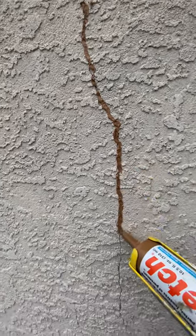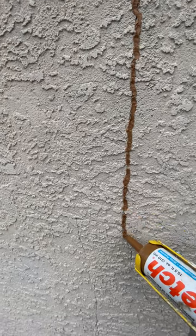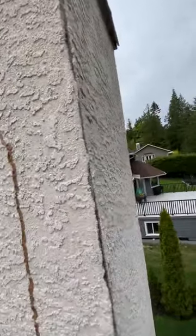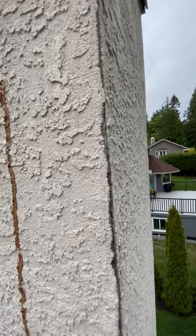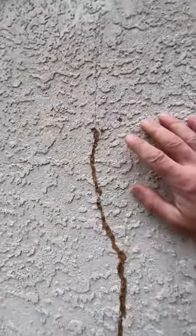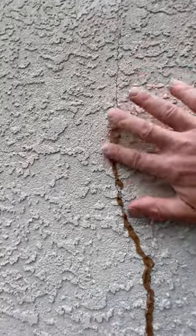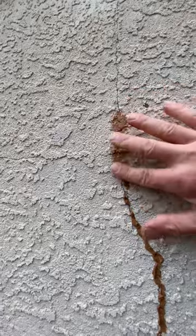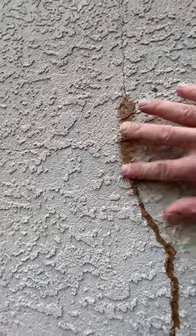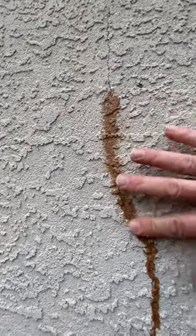I just want to make sure it's done right and that the cracking doesn't continue. I've got a lot of caulking to do — I'll do the sides too where the power washer kind of chipped off a little bit. Use gloves, don't use your bare hand. When you're done, you just kind of smear it in. The good thing about this is that it bridges hairline cracks a little bit better than what the elastomeric paint will do.